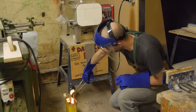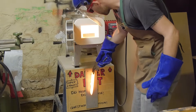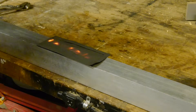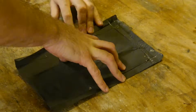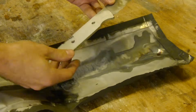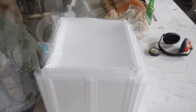Some of the blades were quenched in oil, some were quenched in still air, and the remainder were plate quenched — meaning they were cooled quickly between two large plates of aluminum. Here you can see one of the plate quenched blades being removed from its protective foil envelope.